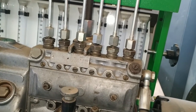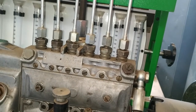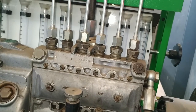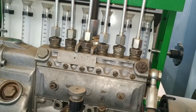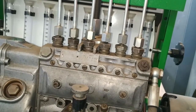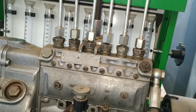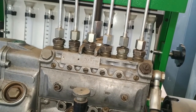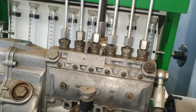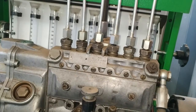If you install this injection pump on a diesel engine with this variation in delivery volume, it will cause unwanted vibration on the engine. Power will be unbalanced between the cylinders — cylinders receiving a larger volume of fuel will be more powerful, while cylinders receiving less fuel will produce less power. This unbalanced power distribution leads to excessive vibration.